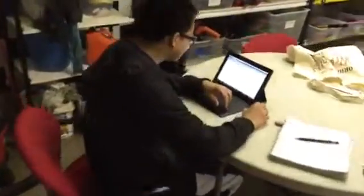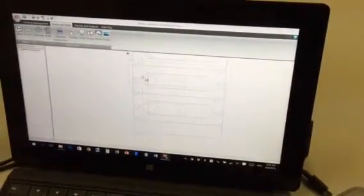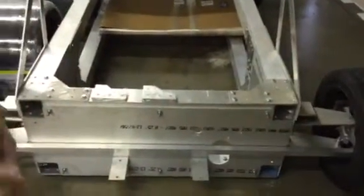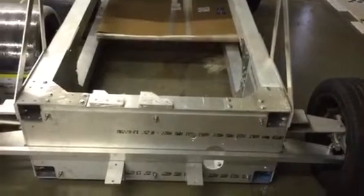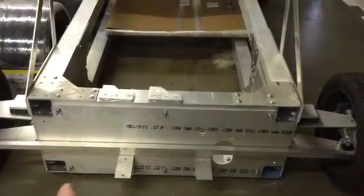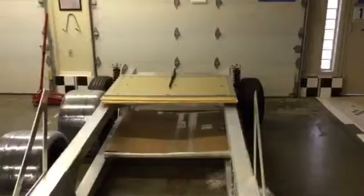Troy has been working on those here. We actually got the CAD done, and now we're getting them all in one CAD file, nested the best we can, so it can be cut in one water jet operation. We've been using Big Blue Saw online — bigbluesaw.com — and they're fantastic. They don't normally allow 48-inch wide parts; they go to 47 and a half to ensure a clean edge on each side when using standard 48-inch wide material. But the Wikispeed car was designed for standard 48-inch wide material, and it's okay if there's a rough edge on the sides. If we upload via email with a special request, they do charge a little more, but they will do 48-inch wide parts like the windshield frame.